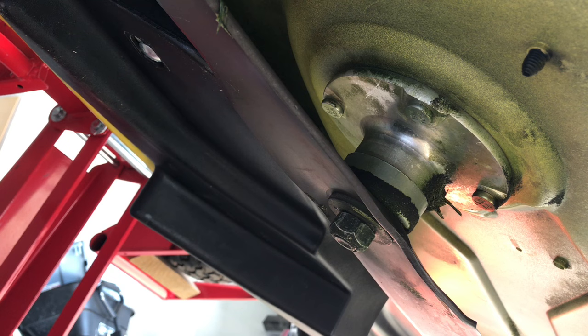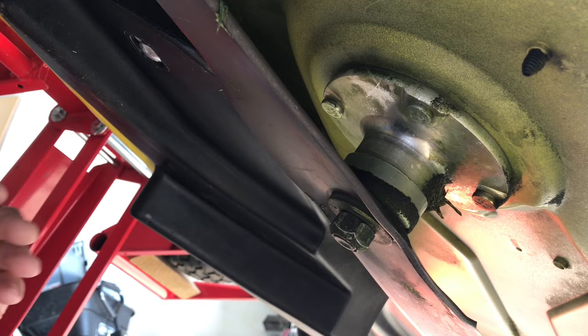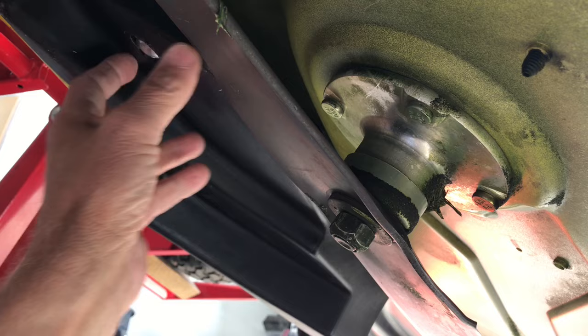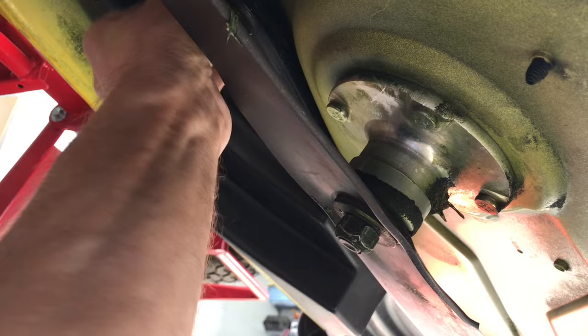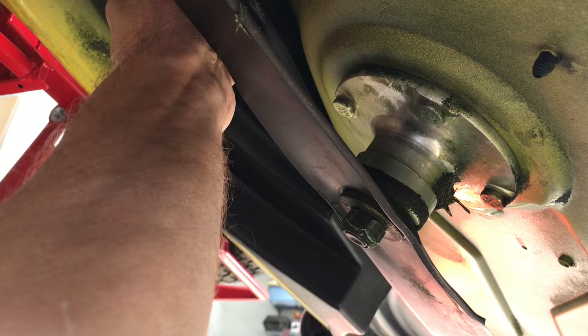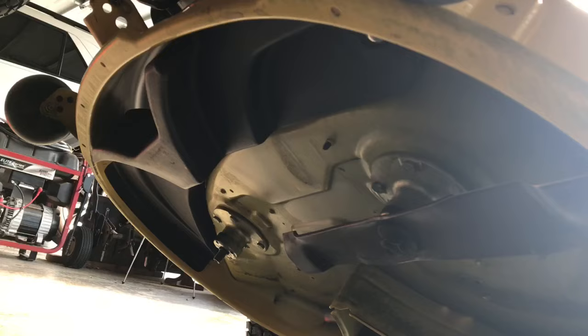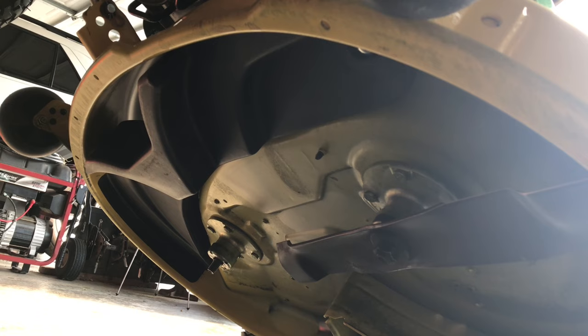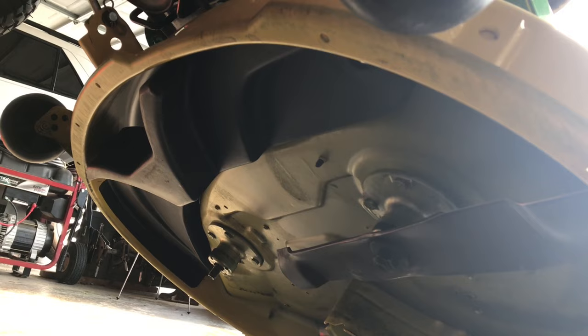On the far side of the deck, that carriage bolt comes with a wing nut. The carriage bolt slides back and forth so you can find the hole up in the deck. Get that lined up, push it through, reach around and get that wing nut on top. Here's the final product after getting the insert installed. Not a bad job — if you use a little persuasion with the rubber mallet and have a clamp, it's going to be a lot easier.